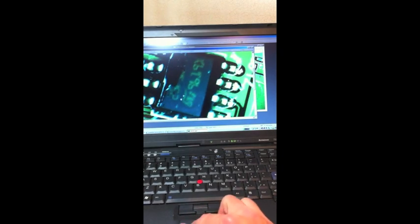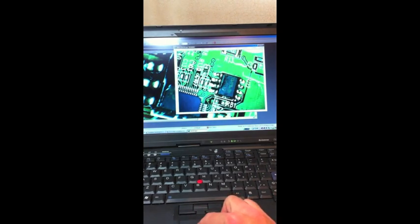I want to make sure I've lined the chip back up and have the right orientation — the words in the same direction, the right pin in the right order. Sometimes the chip will have a little circle indicating pin one. I find it's easier to double check with your photography and make sure everything looks right at the right angle.